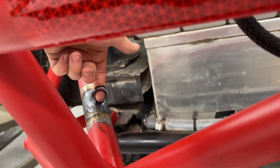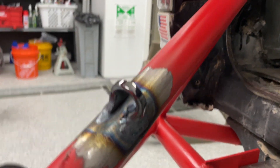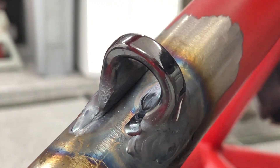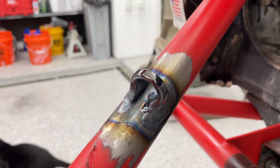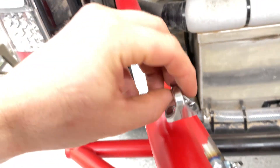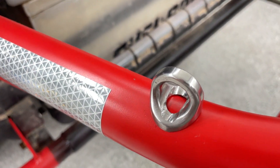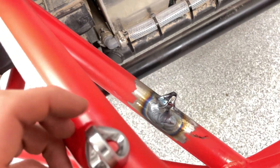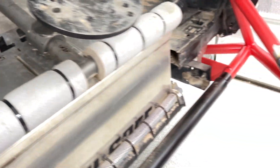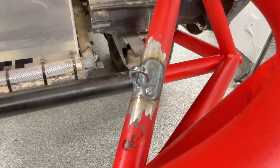Like this thing right here is an eyelet. However, this inside, I do have a weld bead there, but it's not for the reason that you think. Look right here — you're going to see a gap, a razor thin gap. That is nothing more than one piece of material touching another. In this particular instance, I don't want to have any of that edge showing, so no rust can form underneath the eyelet and cause corrosion later. We do that just by welding a tiny little bead on the inside, and that's called a seal weld.